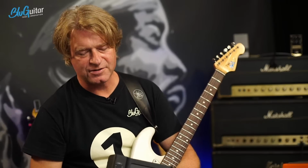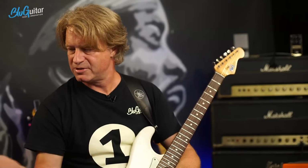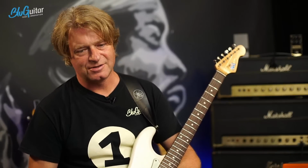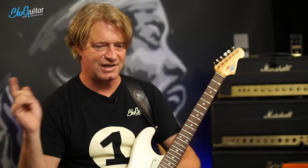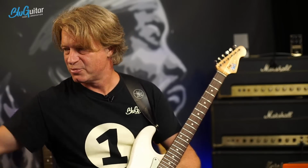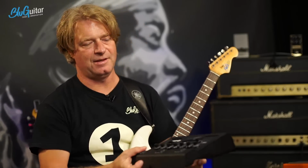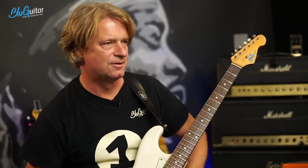This is my philosophy. As you can see from what I've done in the first part of this video, in the AB, in the preamp stage, no tube versus all tube, I don't hear any substantial difference. It is a matter of taste, and I could voice it, I believe, identically. If I spent more time to get 100% this tone, I would get there even without a real tube. In the power amp stage, I'm still not 100% there. We can get close without tubes, but the nanotube is still the thing for me in the power amp stage.